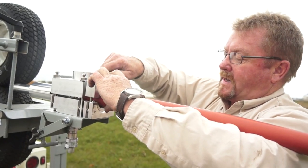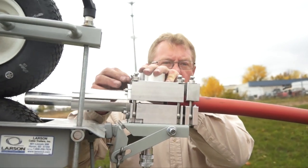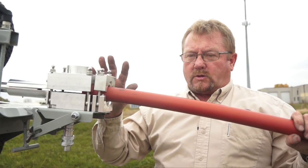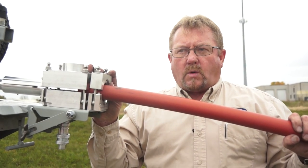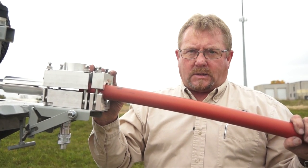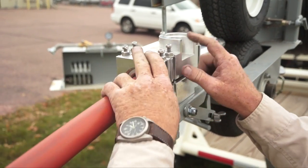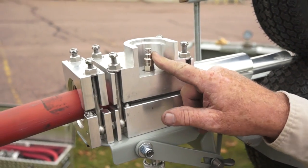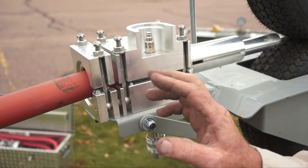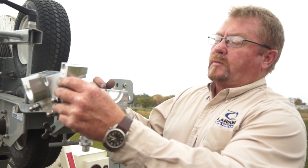This is the same blower block you'll find on Condux's other fiber blowing devices. Once we get that in there and get this tightened down, with this unit we have a much better air seal. We've also got adapters that go clear down to the micro fibers and clear up to a two-inch interduct. On this side you can see where we have the same coupler for the Auto Luber to be connected — so we can add lube as we go with this block, just like we can the other one. Depending on your situation will determine which one you need.